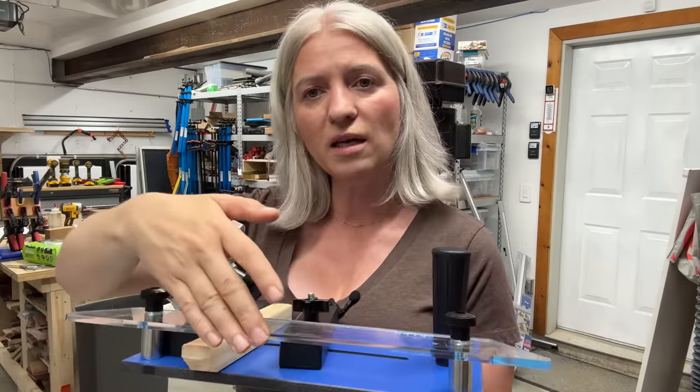What I like about this sled: it works and it wasn't expensive. What I don't like: the toggle clamp doesn't work well for me, which is why I use shims — I set it up for a specific thickness and switch shims when I need a different one. But having one of these and doing your miters on a router table will completely and forever change the way you do miters. You will never go back to the table saw. I hope this was helpful. My name is Skylar Ewing, and I'll see you in my next video.